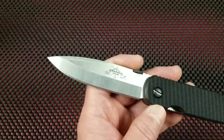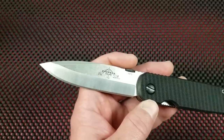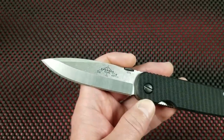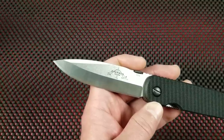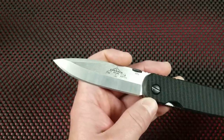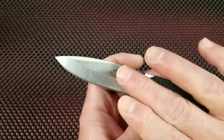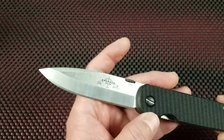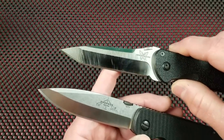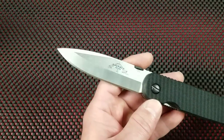Typically 154CM Rockwells at 58 to 61. Emerson says they Rockwell it at 57 to 59, which is a little soft by today's standards for a high-end stainless — but I'm sure they do that to add toughness and impact resistance. They market on that toughness. Corrosion resistance is decent, actually slightly less than 440C — it will stain. This ATS-34 stained on me within moments of cutting tomato. It's not extremely stainless, but it is stainless — a decent steel with good edge retention, good toughness, and decent corrosion resistance.